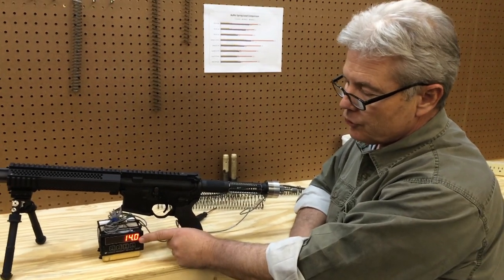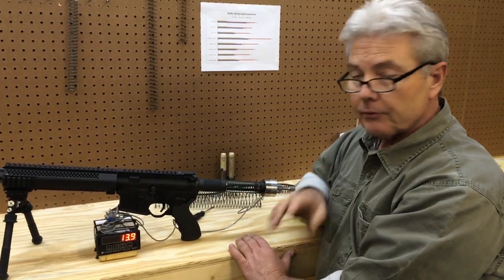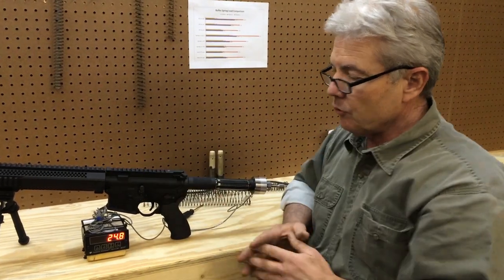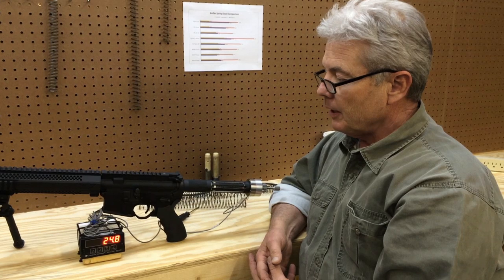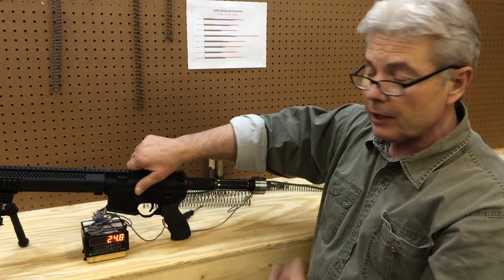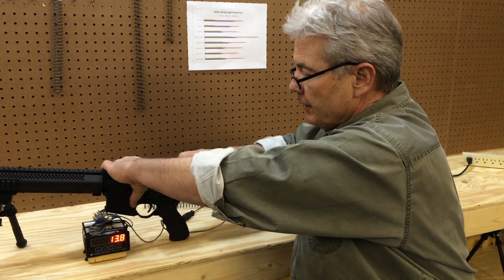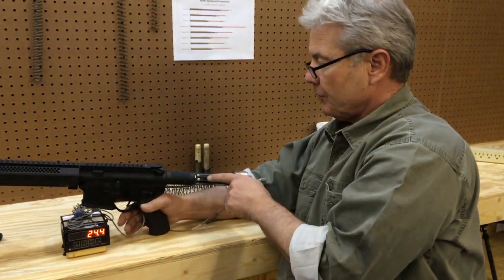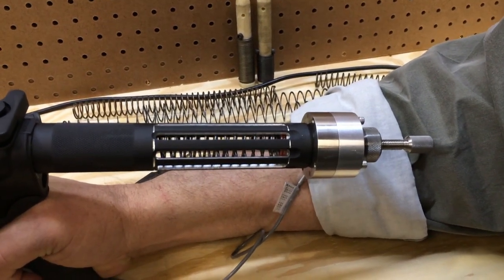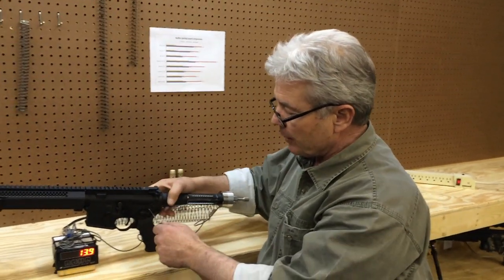This is the 308 spring — so-called heavy spring. It's got 14 pounds of load at position one — correct. But look what happens at the rear: it has 25 pounds. When you close the bolt on this, the first time I did it I thought the gun went off twice — once when I shot and once when the bolt closed. And watch the spring vibration when I close this — you're going to see a vibrational node really give it to it.